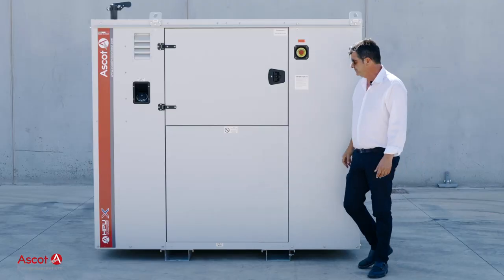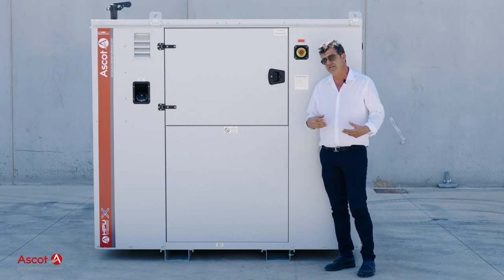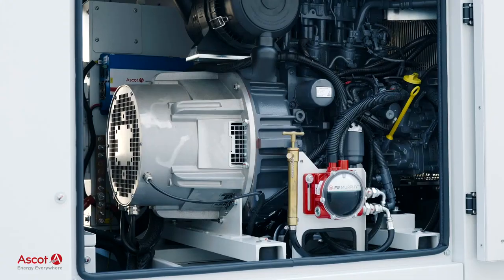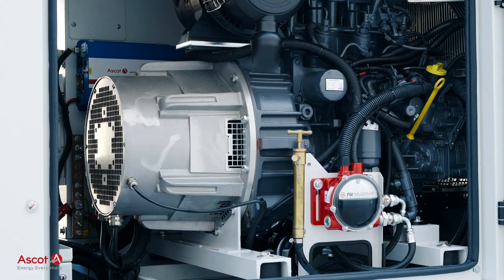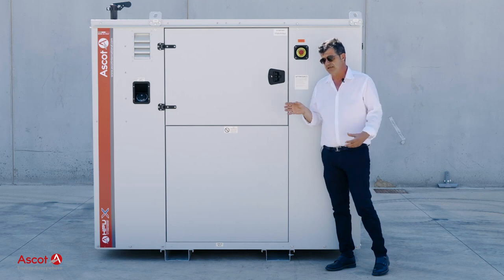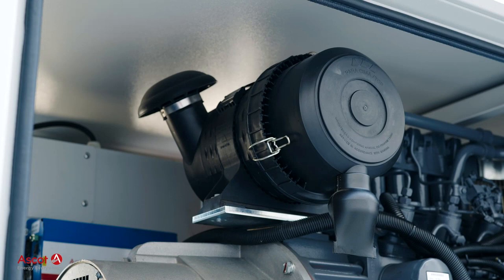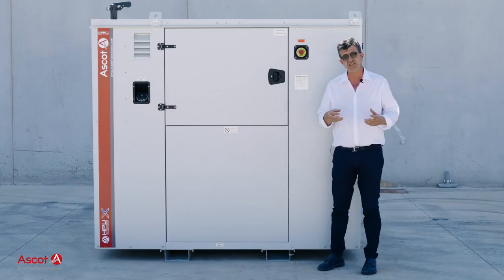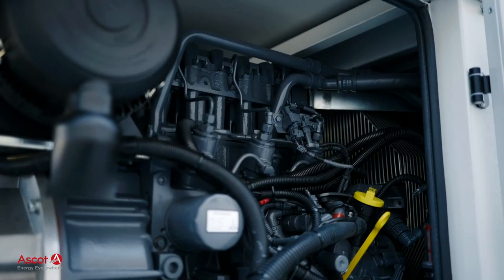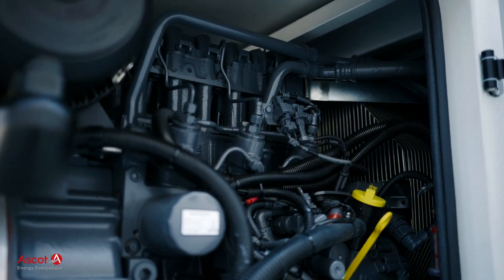Just to give an example of the energy efficiency improvement using the HPU, without the contribution of the solar panels, the engine for a load of 3 kilowatt will run only 5 to 6 hours per day, consuming about 27 liters of diesel per day.